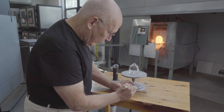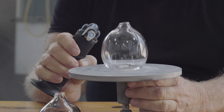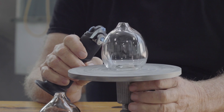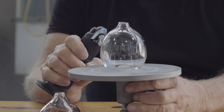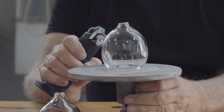After the vessel is cooled, a diamond on the tip of a handle is used to scratch the glass. In modern times, a little torch is used to heat the glass at the circumference, at the location of the scratch. After a few seconds, the glass cracks.